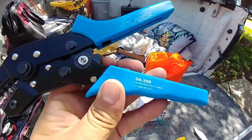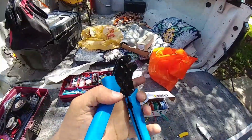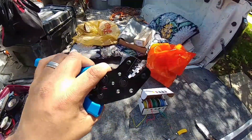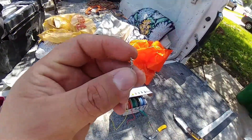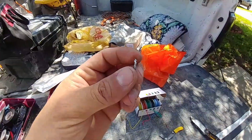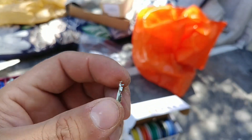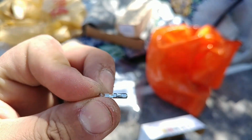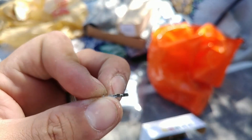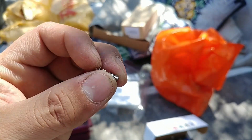You're going to need some crimping pliers. These are for non-insulated terminals, which is what we're doing here. I don't remember their exact terminology, but they crimp this type of connector. The wire comes in from this side going down — you don't want the exposed wire to go past where my nail is. The insulation of the wire is going to get crimped by these two little ears when you crimp them down.